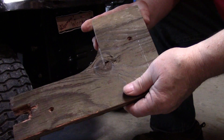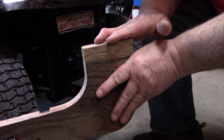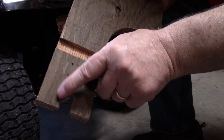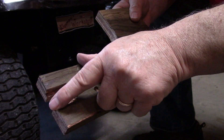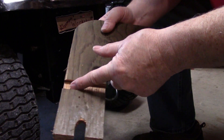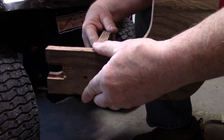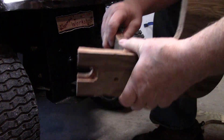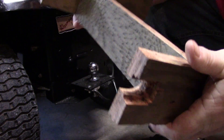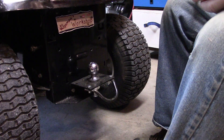I've finished cutting out the plywood pieces. The top part is now four inches, which gives more support for the bed. The notches are five-eighths inch diameter with a five-eighths inch slot, and I recessed the other side to adapt to the bushing and collar in there. I also rabbeted it to make room for the cross piece that goes on like so. I made two of them — one for either side. Let's try it and see if it fits first of all before I get excited.